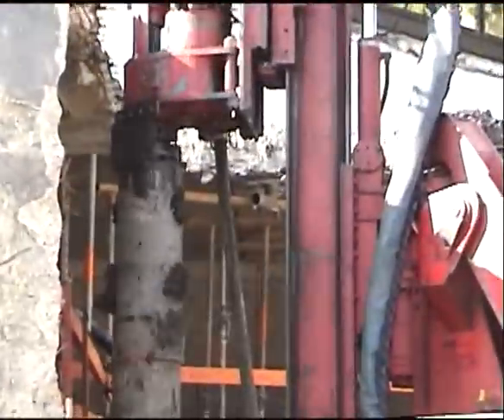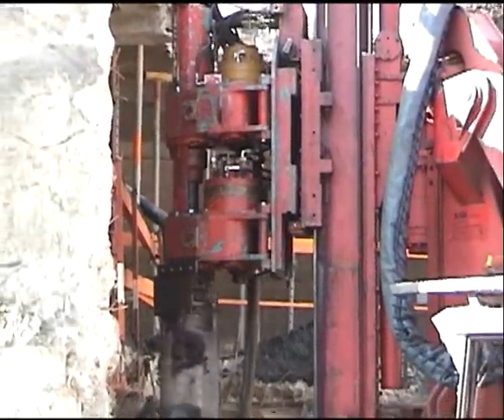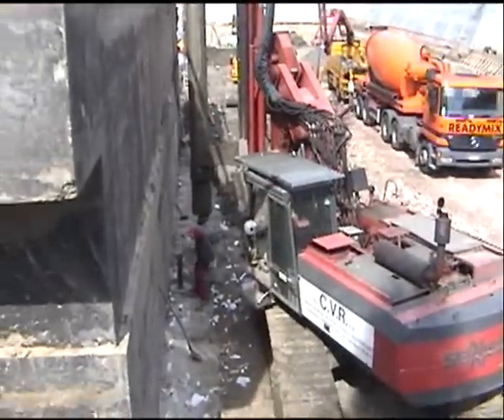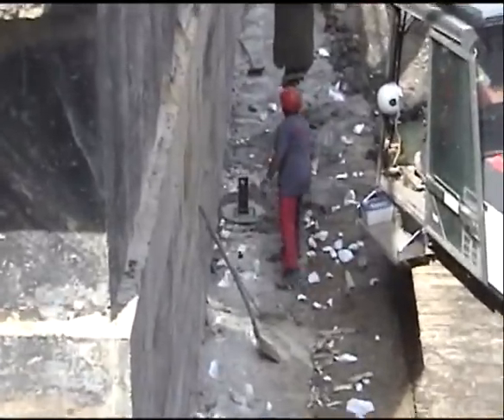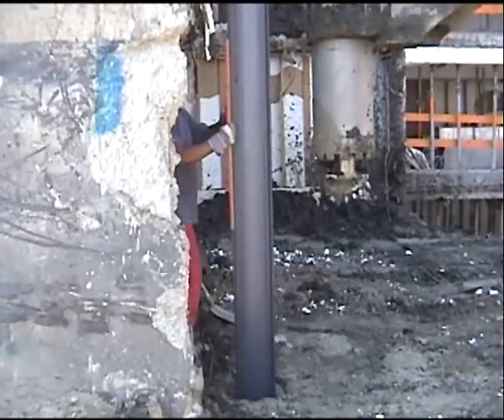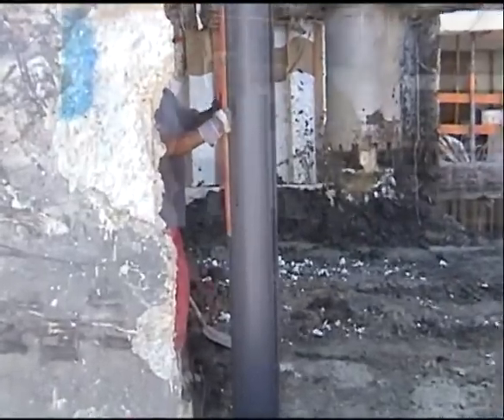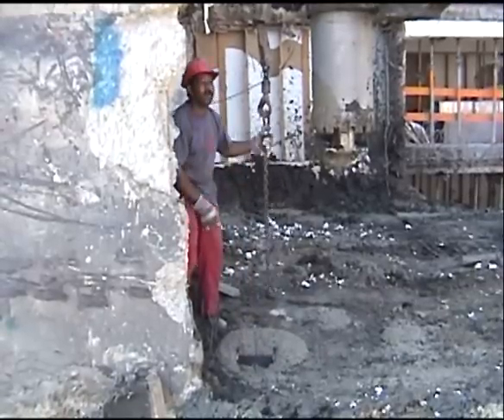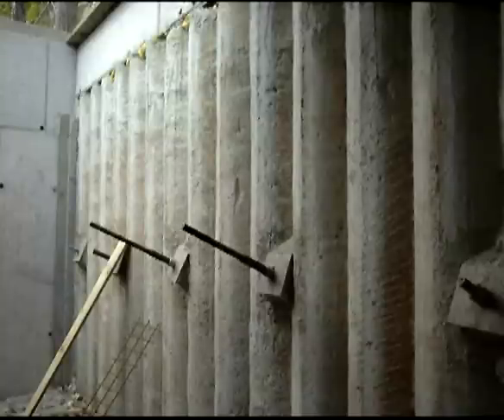The primary piles are cut into and overlapped by one-third by the longer load-bearing secondary piles. Secondary piles are drilled no later than three days after the casting of the primary piles. To prevent twist-off, the primary pile has a small three-inch beam placed into it, while the secondary pile gets a much larger 8 to 12 inch beam. The walls are often in such good shape that they are left as-is in the underground car park, or can be cleaned up using a special ABI tool.